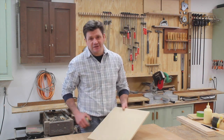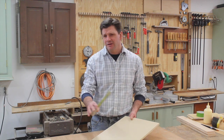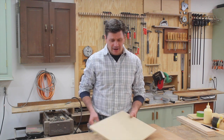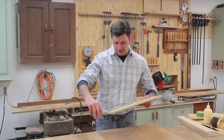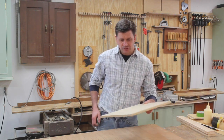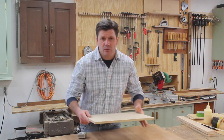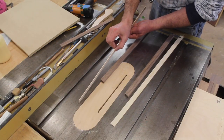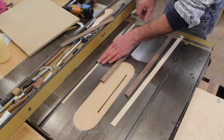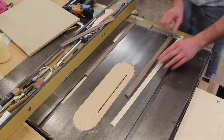I'm going to get started with a piece of half-inch MDF — you could use plywood, maybe even three-quarter plywood, really whatever you have hanging around the shop. This piece measures 13 and a half by 17 inches. I'll bring it over to the table saw and mount runners at the bottom, because this is going to work exactly like a crosscut sled. I'm using shims cut to a sixteenth of an inch to prop the runners just a little bit above the surface of the table saw.